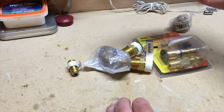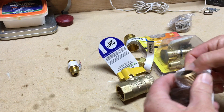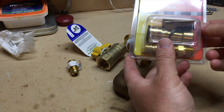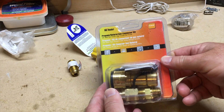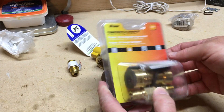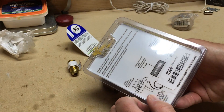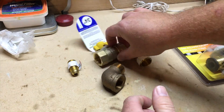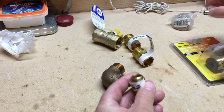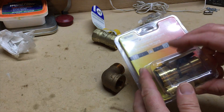I got a bunch of parts here that I purchased through Amazon. Essentially I have to go from three-quarters of an inch down to three-eighths. The main quick connect here is a Mr. Heater — you can see that — and this will fit a lot of different types of connections as far as different brands. I think Charbroil, Mr. Heater, and one of the other big companies uses this type of connection. I have a shut-off here that's ready for gas, and eventually I'm getting down to three-eighths flare.